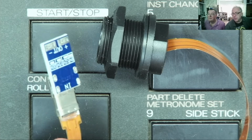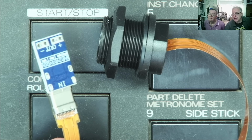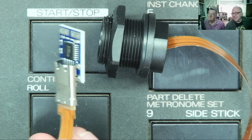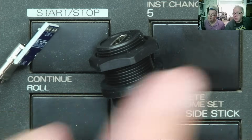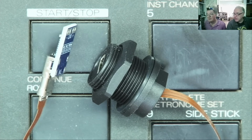Okay. Yeah. So this talks to the power supply and tells the power supply, I want to have something volts. And this is set to, okay, look, there's 9, 12, 15 or 20. Yeah, there's no marking on there. So this is set to something on there. Okay. Yeah, this would be my solution here, because now I have USB-C. And I have something like 20 volts. Okay, and that then would go into something like my little adapter.